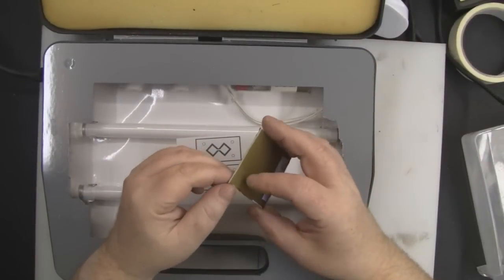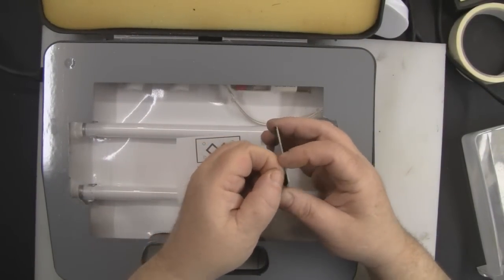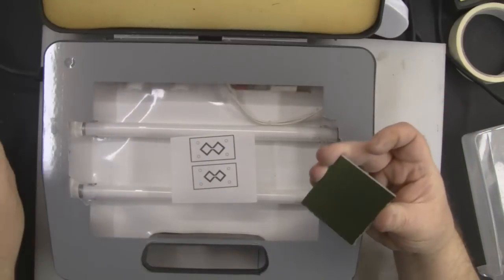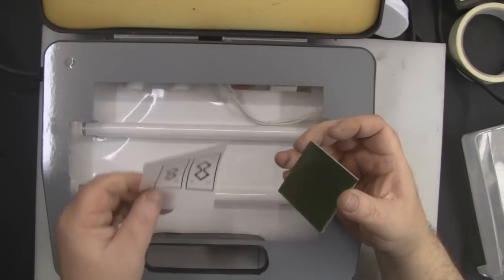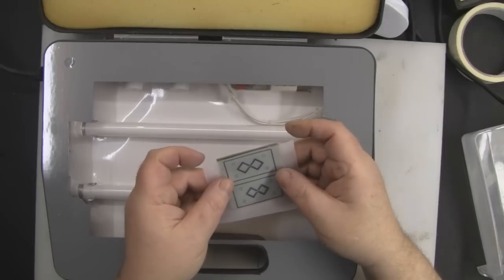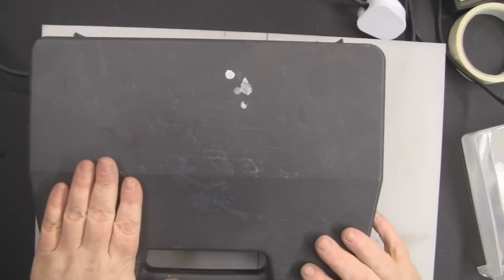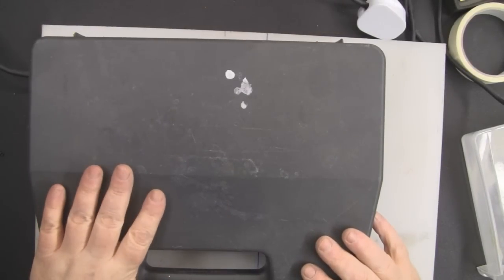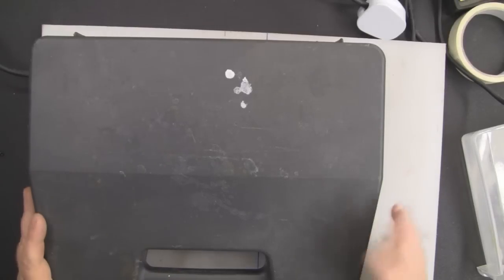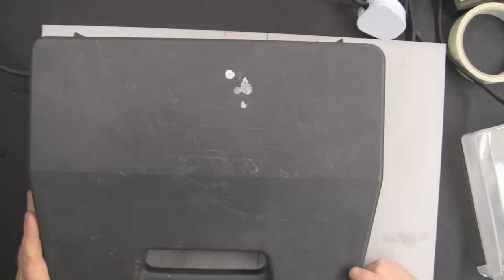So to develop it, what you need to do is peel off the protective layer on the board itself to expose the photoresist surface, and then place the image over the top. Now my particular box takes about 2.5 minutes of exposure time. Some of the more modern light boxes, and the little LED ones I've seen people make up, can cut that time down. So for my box it's about 2.5 minutes.